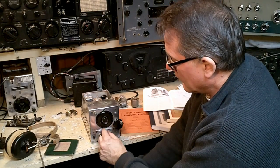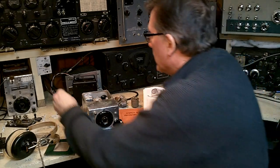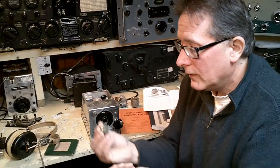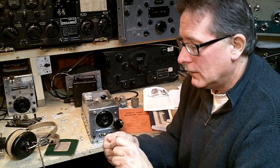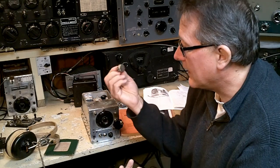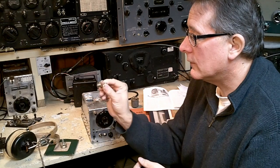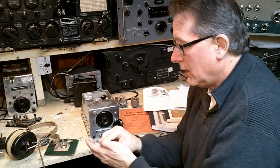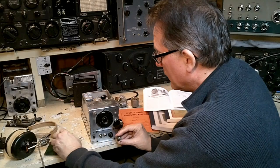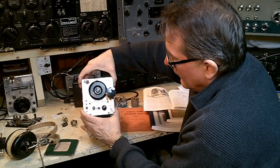So this area in the front where a plug-in went originally on the receiver usually was where they mounted these components. A potentiometer, usually between 20 and 75K. 50K was a popular value for the gain control. A phone jack. It could be a regular two-circuit phone jack, and a switch to turn the BFO on and off. Now those three components could be put on a small plate that would mount on the front of the receiver, and that would give you